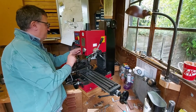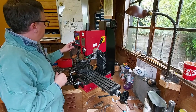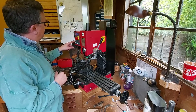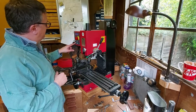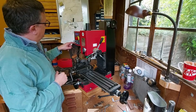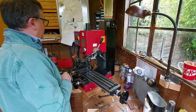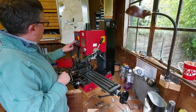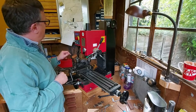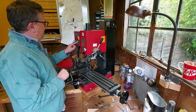Simple on/off — it's on. We change the speed with plus and minus in 10 RPM steps, and it will go all the way up to 2000 RPM, or if I go all the way down, it's down at 40 RPM — that's the lowest point. I can swap the direction, forward and reverse, just at the touch of a button. It tells me clearly on the display it's forward. So let's do some milling — turn it off.